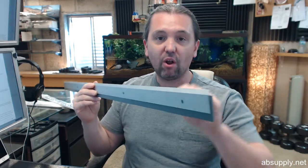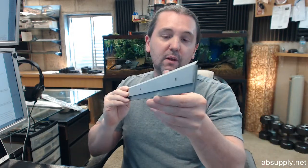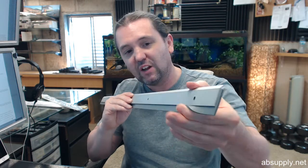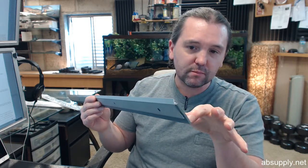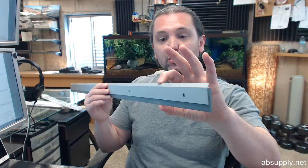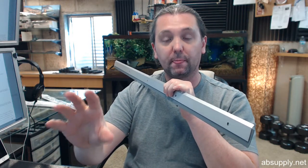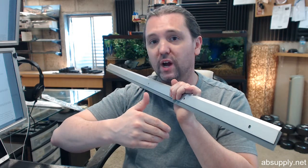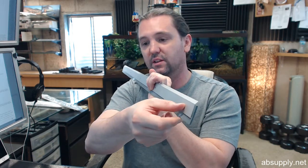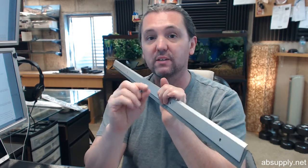It will typically have neoprene installed, but this is silicone. I like the silicone because it's significantly more flexible. That allows the door to give ultimately a better seal, because it allows you to tighten up a bit better on the bottom of the threshold while still allowing the door closure to do its job. If you've got something far too rigid at the bottom, your installation might have to be slightly compromised — whereas you can cheat the margin a bit tighter when working with something more flexible.